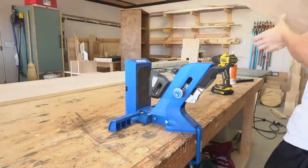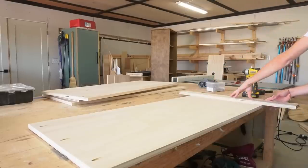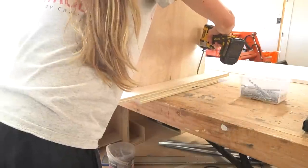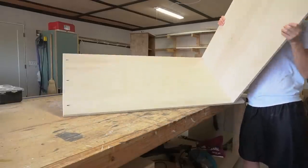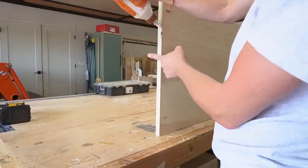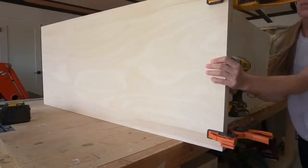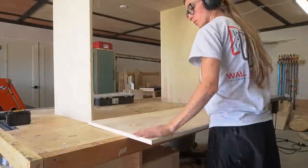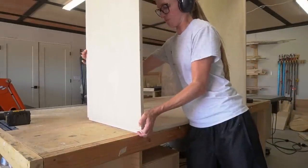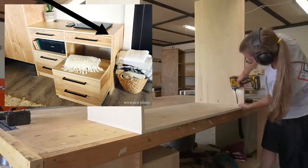The bottom half of this closet system was basically a large, plain dresser, so first I built a dresser carcass — really just a large box. I edge-banded the front sides of the plywood pieces and assembled using wood glue and pocket hole screws. I tacked the bottom panel about 3 inches up from the bottom of the sides so I could cut and install a toe kick later. I used a scrap block to keep my spacing consistent. Since this was going into a nook and the sides wouldn't be seen, I kept it simple by attaching the top so the edges were flush to the sides. If the sides were going to be exposed, I may have opted for mitering the corners like I did on my dresser build last year.